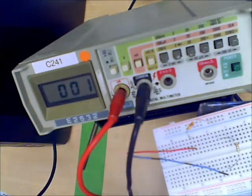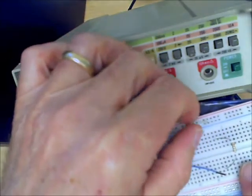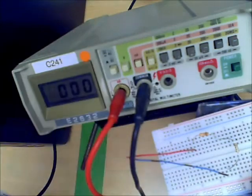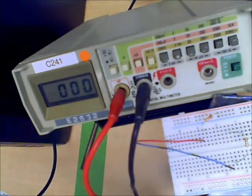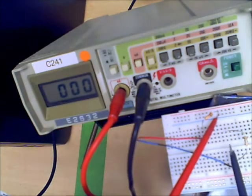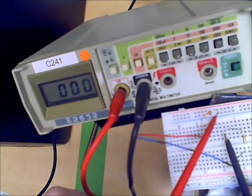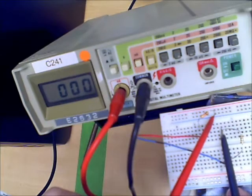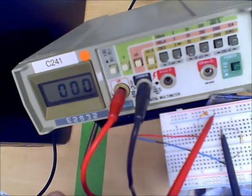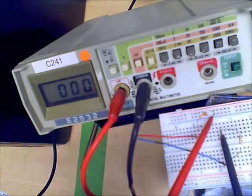All right, so ammeter measurements are always a little more difficult. You first have to remember that you break the circuit. So where the configuration here shows 2 resistors in series, I have to open the circuit up so that they're no longer connected to each other. That leaves, if you will, a hole in the middle of the circuit, and then I take the ammeter and I fill that hole. I put the red lead on the end of one resistor. I put the black lead on the end of the other resistor. That completes the circuit. Whatever current those 2 resistors were causing to flow will now flow. The ammeter will record that, and I have the reading in front of me as desired.